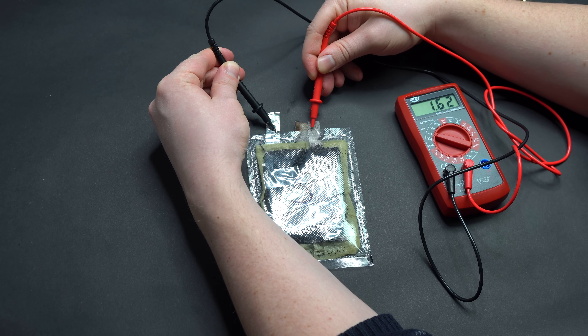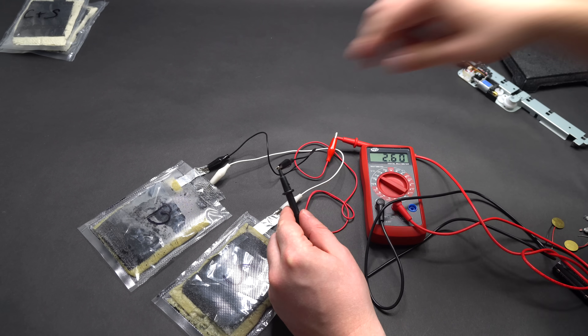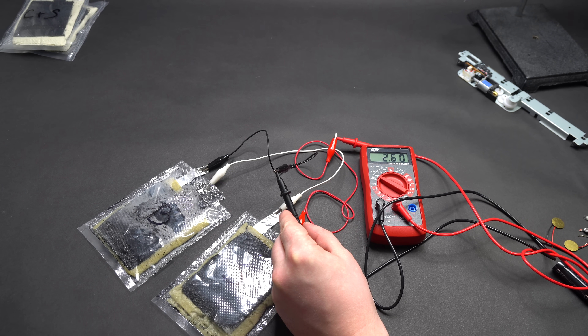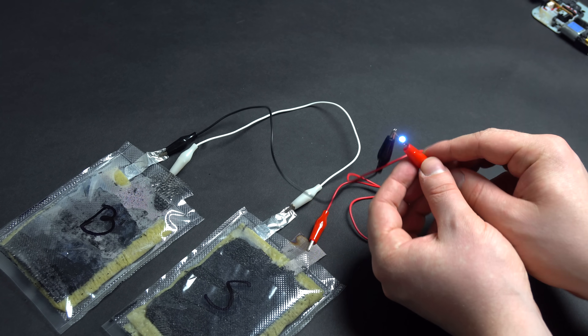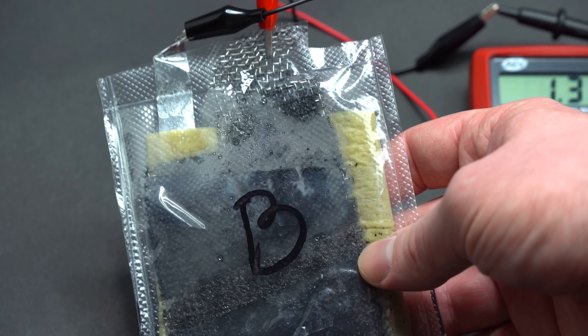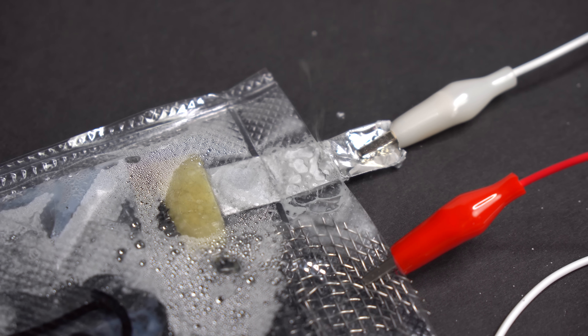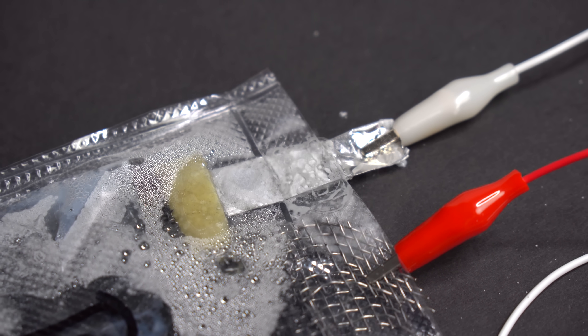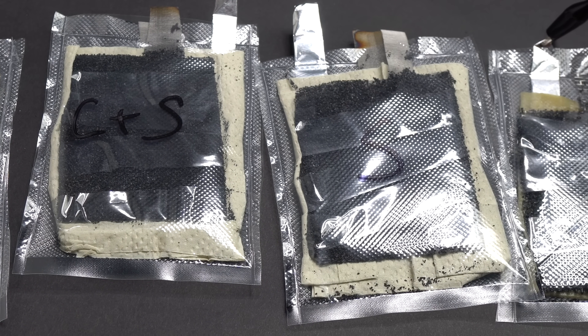I have tested my other batteries. As I anticipated, the best-performing battery turned out to be the one with the current collector from a mesh with narrow gaps and without a graphite layer. If you connect two of such DIY batteries in series, the voltage will double to above three volts, which is enough to light up a simple LED. A red one requires less energy and is easier to light up, whereas a white one needs more volts. The only problem is that the aluminum foil starts dissolving when sodium hydroxide is added, so such a current source can only run a few hours. However, if the battery and electrolyte are stored separately, they can last 10 years and be used in an emergency.